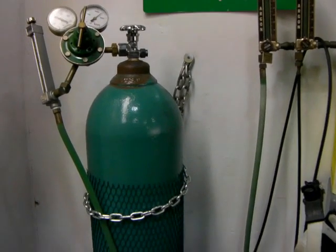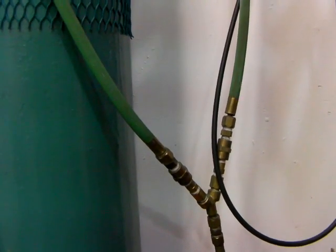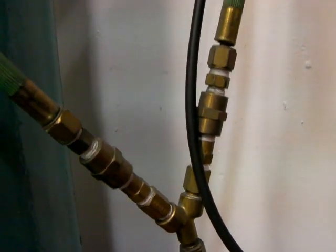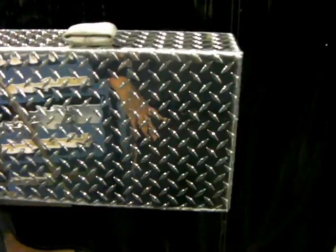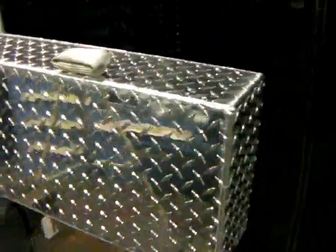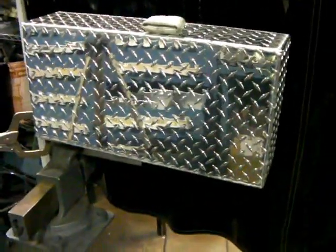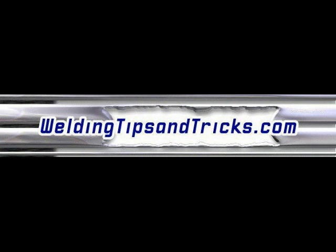So once again, you're going to need a regulator and a flow meter for that helium tank, and you're going to need a Y and two check valves. Then it just goes off into your machine just like it would if you only had argon. You can spend a little money and use a Y with valves on it — it's a standard product from places like Western. Your welding supply can hook you up with a Y, no problem. It's just another tool in the tool belt, another weapon in the arsenal to make you more versatile. And if you're using a 200-amp inverter or even a smaller AC/DC inverter at the house, this is going to really open up what you can weld with it without popping the breaker or overheating your machine — it's just going to make a difference.